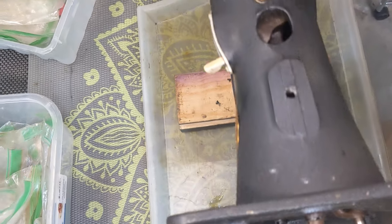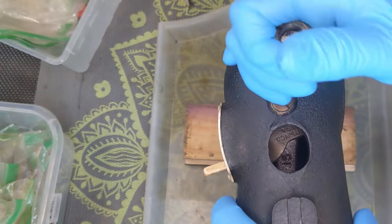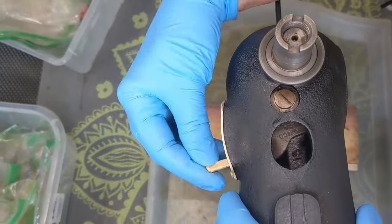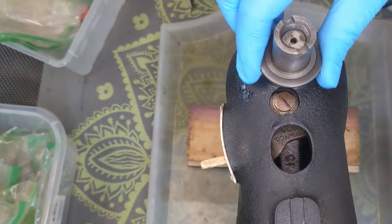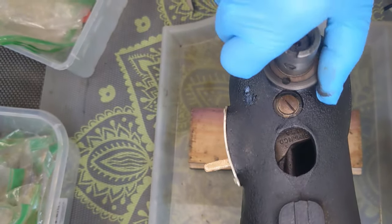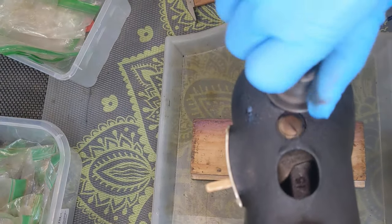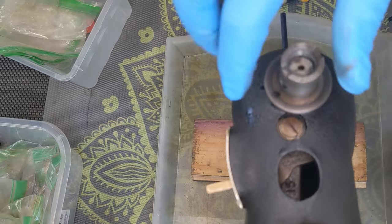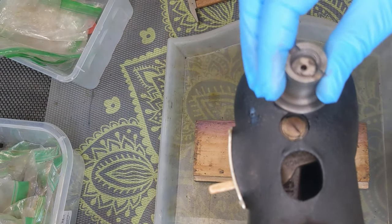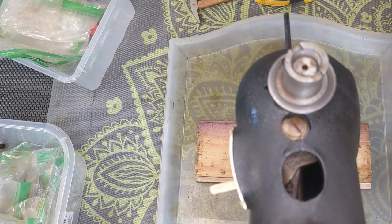Good morning — it is the next morning and I'm ready to get back to work on her. The only thing I really still need to take apart is the whole stitch length mechanism, arm, fork, and everything like that. I can tell that if I wiggle the arm, it releases the wheel somewhat, so I think that arm being in contact with that rusty area was really doing a lot of the binding on this machine — that plus stuff up in the nose. I have a lot of hopes this is going to turn out well.